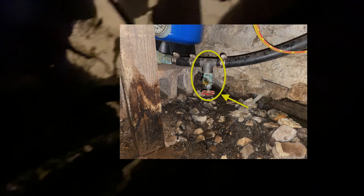The last valve to close is the inline from the well itself. It's going to be this big thick black hose coming in that's heading into the pressure tank. Just before it gets to the pressure tank, there is one more valve that should have been opened up when the place was closed down. You're going to want to close that valve before you turn the water on — or trust me, it's going to spray quite a large spray of water.